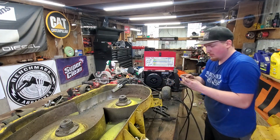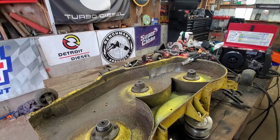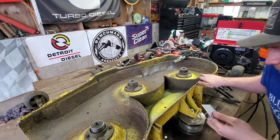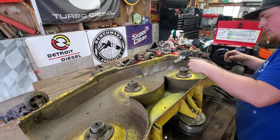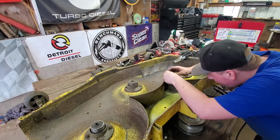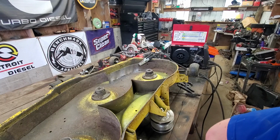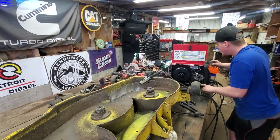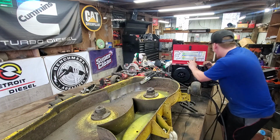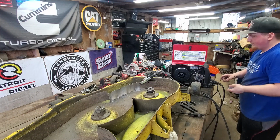So we are welding some, those are some test welds I did. The thing felt like the wire was slipping, and I have this little gauge to help me out set the correct setting for the unit, because I don't weld much. I mean, I have tons of welding videos, but I need to definitely know. 1/8. 1/8 there on the mower gauge. So what you do from there is you go to the unit, you go 1/8. Okay, self shield 030, 035, we got 035 in there. 1/8 F6. Okay, we are set there at F6.